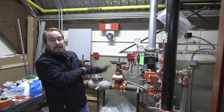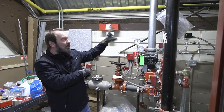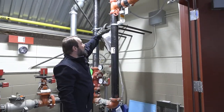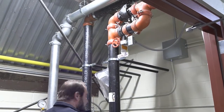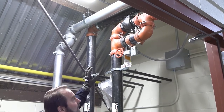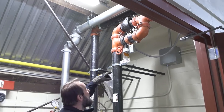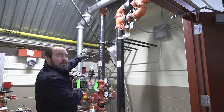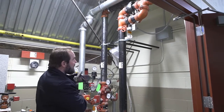If you don't have water in the system, the fire department may come in and hook their pump truck up to that connection and fill the system. This particular valve is a forward flow test — it ensures you have the proper amount of underground pressure coming through the system, usually done every three years during a regular annual inspection. You open it up, send water to the front of the building, and put a pitot on it to determine water pressure.